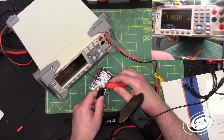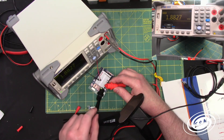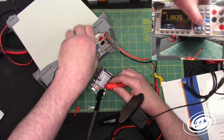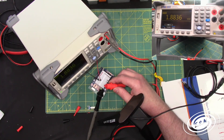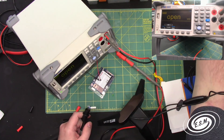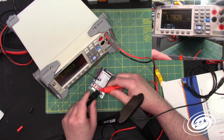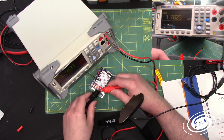Testing this diode — it's got a forward voltage of 1.8. We can change the threshold voltage across it, but it's still reading a voltage drop. That must have been the auto set. That's pretty cool. Let's check another diode. Let's pull one of my red diodes out here. It does light the diode. This one has a 1.7826 voltage drop, or forward voltage. That's pretty cool — diode function.